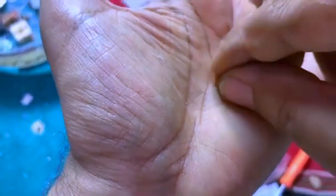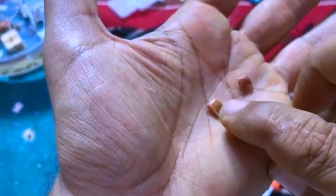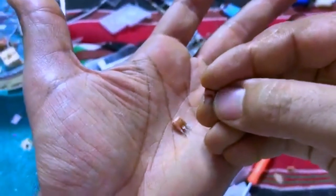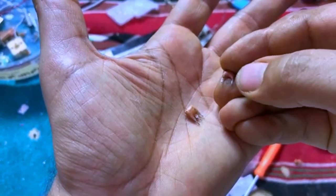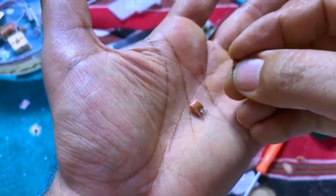These are a group of FM ceramic filters. We have two types — the three-leg type, which are all 10.7 MHz. Each one has a red dot indicating the positive side, which goes to the positive rail. This one is used to filter output from a ratio detector. If you cannot find one like this, you can make a transformer instead — I'll show you how — and that transformer has a pink dot.